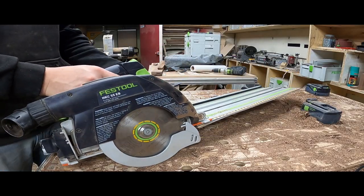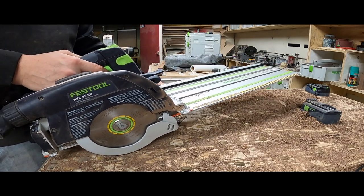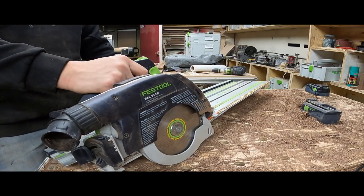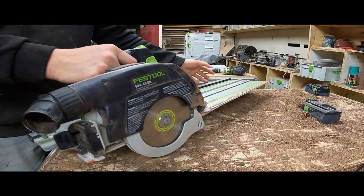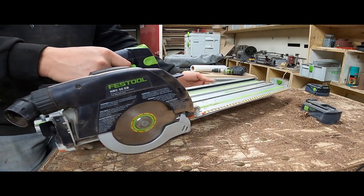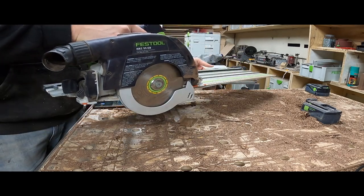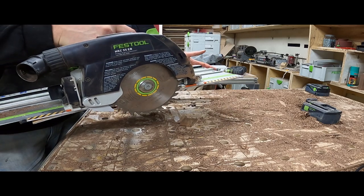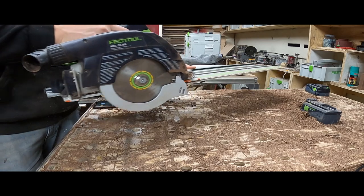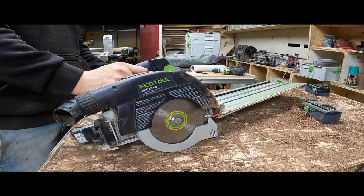This track is honestly the coolest thing you can imagine. With this saw, I've actually done entire flooring jobs in a house, trim in a house — baseboard, casing. I've done casing and baseboard with this saw alone. These tracks come in multiple different lengths and they're fairly accurate in terms of setting a 90, but what's really annoying is that no matter how much you lubricate it, clean it, it just doesn't slide that well on the track. It gets stuck a lot of times and you kind of got to shake it back. They say just clean it, it's not clean enough — it just doesn't really work that well, to be honest.